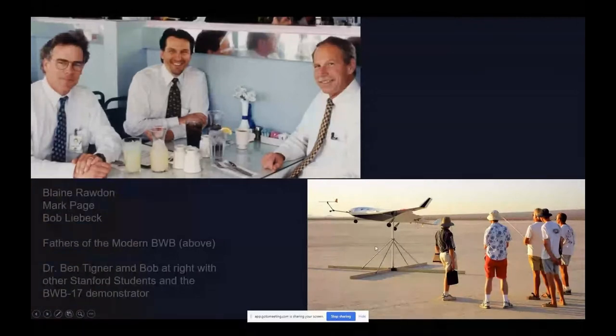This is an instance where we were out flight testing on a very windy day. We put the airplane up on a pole and we were exercising the flight controls and making sure that the closed loop gains on the pitch, roll and yaw dampers were working properly, with the alpha vane here on the nose and whatnot, and the airspeed sensor out in front.